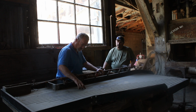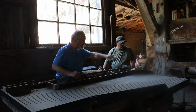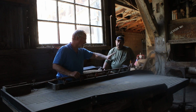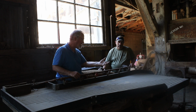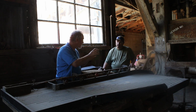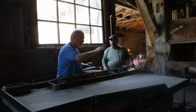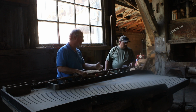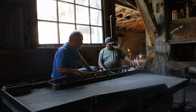I don't know if you can see the riffles here, but there's a number of these riffles going down. The smaller gold will catch on these riffles. It won't go over them, but it will work its way out and continue to work its way across the ends of the riffles and down to the side of the table that goes off that way. And so you'd have different collection troughs: a collection trough for waste, and then a collection trough for the best. Usually there's either a number 1 middlings, which is not the best but the next grade down, and sometimes there's a 1 and 2 middlings. So you get the good stuff, the waste, and then middlings are what you have in between, and you may have 2 different levels of middlings depending on how rich it is. You may want to retreat those or do something with them.